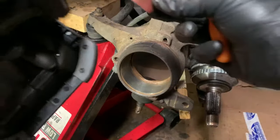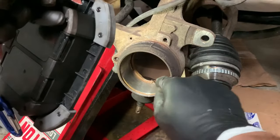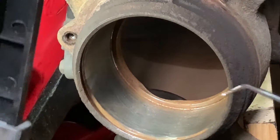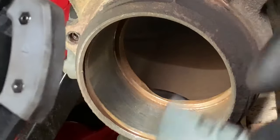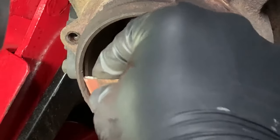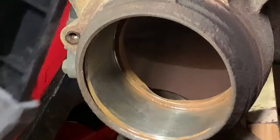Once your bearing is out, I just took this pick and got in there and tried to scrape away. This is that lip I'm talking about — as you can see, it doesn't go any further. Just tried to scrape all the rest that was in there as well as this groove channel where the snap ring goes since it was so kind of jacked up. Then I just take a little strip of 600 grit sandpaper, keep folding it in and basically getting it in that groove, doing this all the way around as well as pushing it all the way up against the back of that surface.